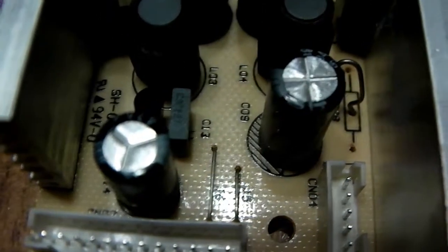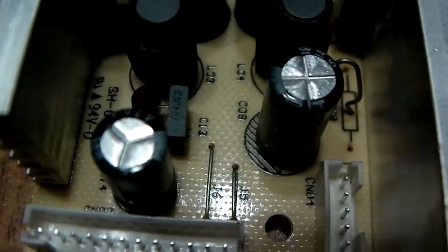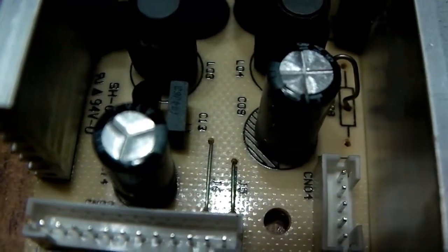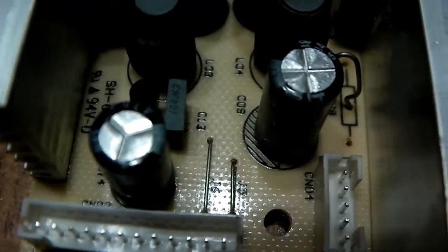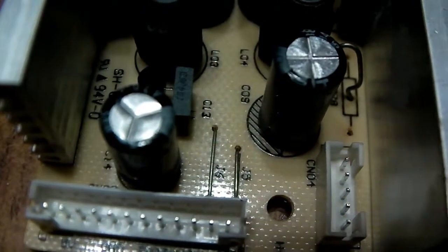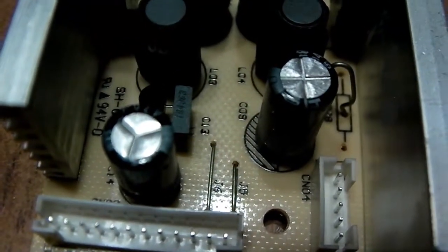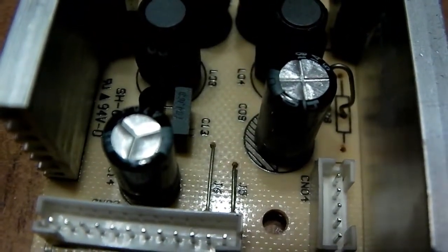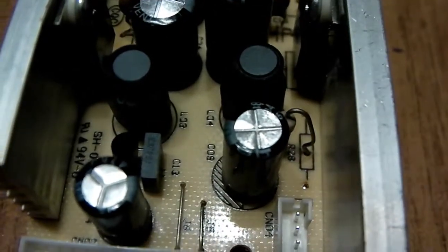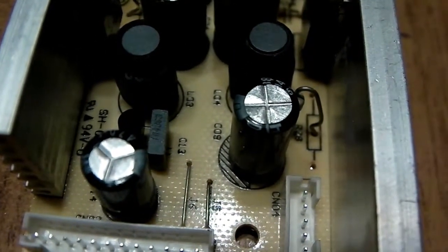The negative side goes on the side with the lines running through it, and a lot of manufacturers will mark theirs a little differently, but yeah, if you get them switched around, like a positive on a negative, negative on a positive, the cap again will explode out the top like a cap gun. So make sure you get them right.